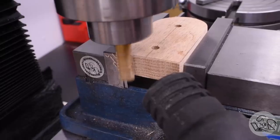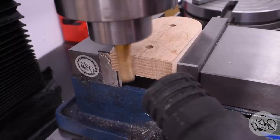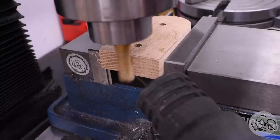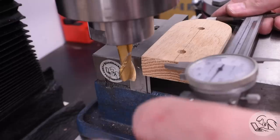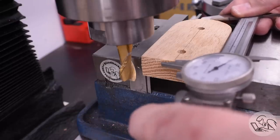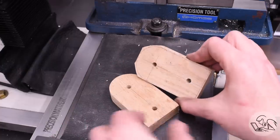And finally, I trued up the bottom of the form. This isn't really essential because there's no flange on this side, but I did it anyway. And I could have done this on the rotary table if I had a better spacer set up besides the parallels that I was using there. That's the backer, and I can now make the former the same way, which I did,